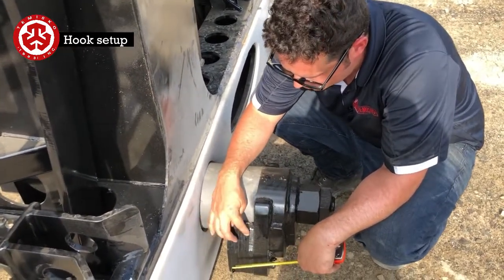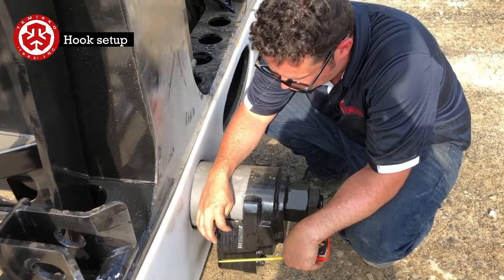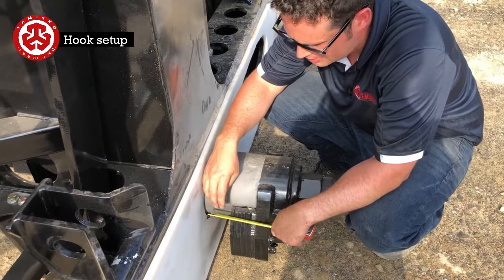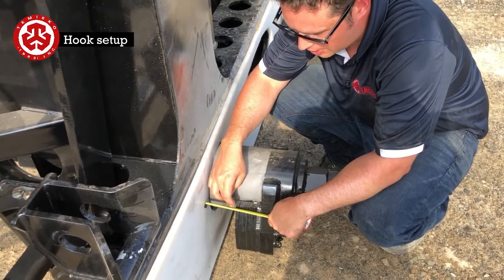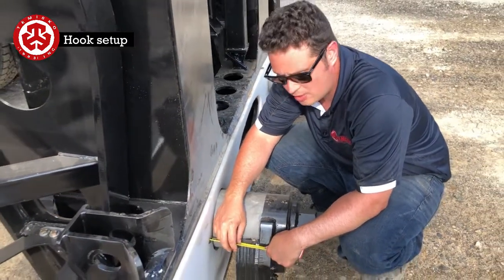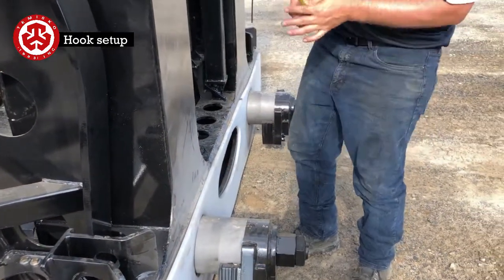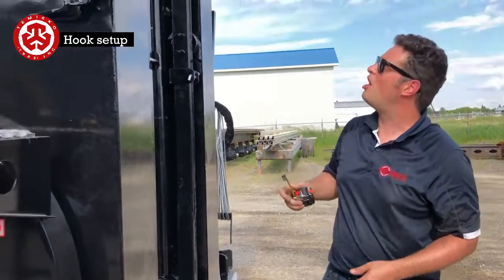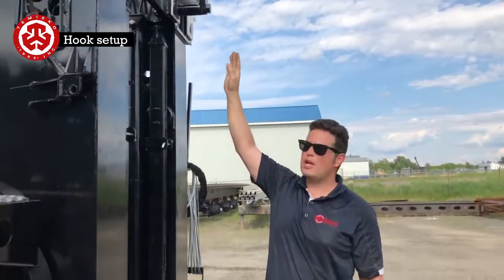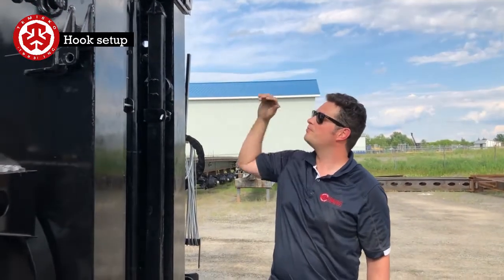There are different size shims here, so you can pick and choose which one gives you the correct thickness. I always go with 3/8 more than what the tower is, so you're able to take it out. No more than that. It's the same thing on top. You're going to have those shims on top there, and you go and measure to make sure you have the right ones.